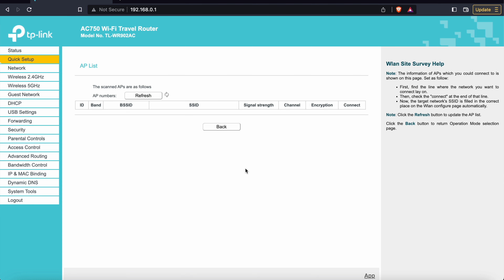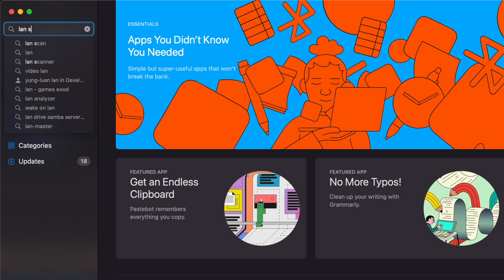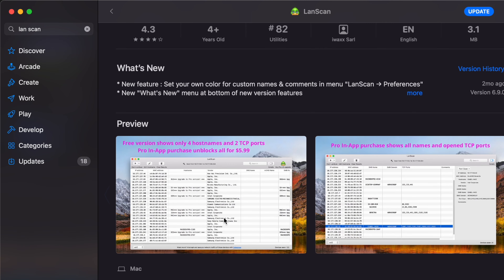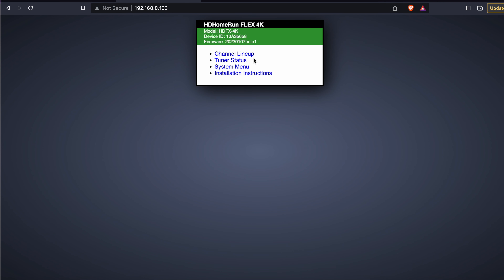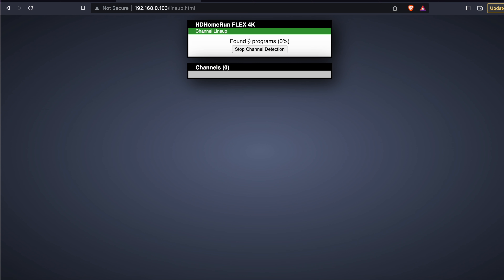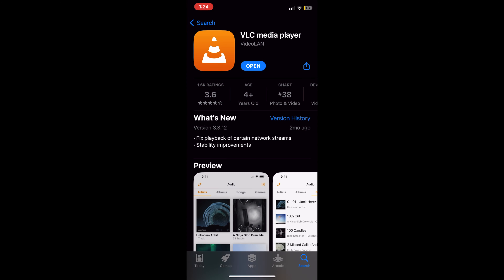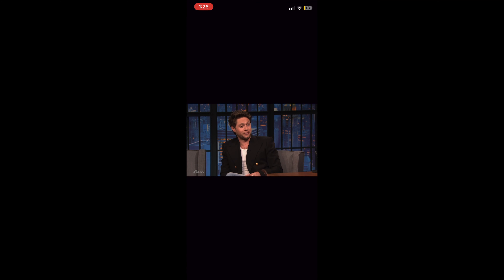Remember, you don't have to set up your router with an internet connection. Next, connect your phone, computer, or tablet to the wireless network produced by your router. Then download an app for locating local IP addresses on your network. This will help you determine the IP address of your HD Home Run. Once you've downloaded and opened your app, find the HD Home Run's IP address and type it into a browser's search bar. Once the page is loaded, tap on Channel Lineup and then tap Detect Channels to complete a channel scan. Make sure it's set to Antenna. Once the scan is complete, download VLC for your devices that you plan to watch TV with. Under Universal Plug and Play, choose HD Home Run, click on Channels, and select the channel you'd like to watch. You're now streaming free live TV without an internet connection. As long as you stay on the network you've created, you'll be able to watch TV.